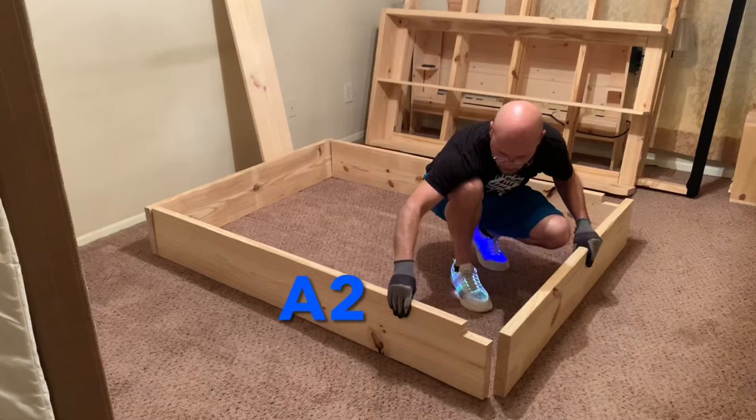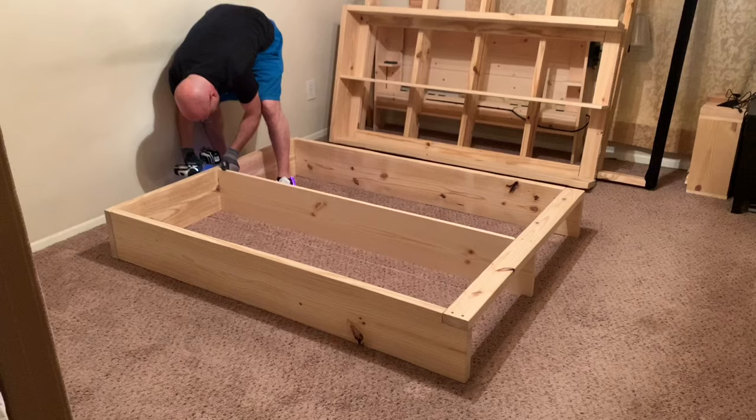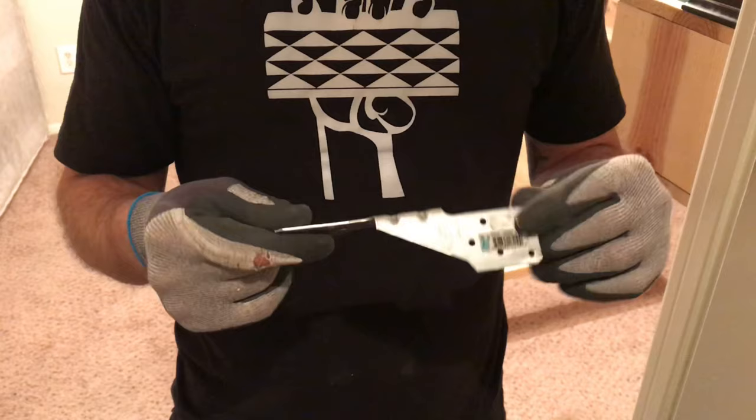You won't need those notches unless you want to modify it for storage, and you do that simply by trading the footboard in the base for a two-by-four. I'm using three-inch fasteners to make sure everything is very secure and I recommend the same for you. From the headboard area, measure to 16 inches, 33 inches, and 51 inches on both sides and make a mark — this will be for later. This right here is a Simpson strong tie; it's basically just a twisted piece of metal, they're less than a buck and they're so easy to use.